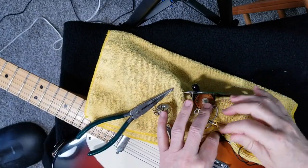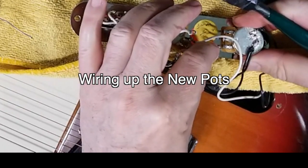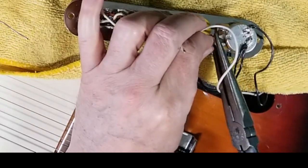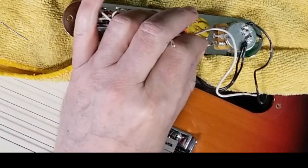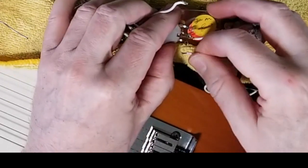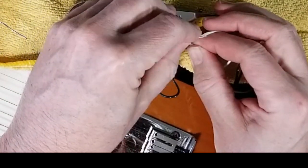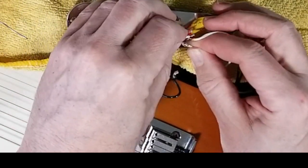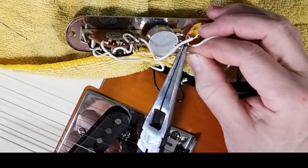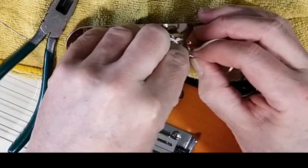All the parts are off. What I like to do is get these in the hole and turn the wire around and kind of press it in together, so that way it feels like it's stuck in there. Even without the solder, I want it to feel steady. Then over on this other hole, I'm going to do the same thing — except that hole is going to receive two wires. I'll thread in the second wire and see if it fits in the same hole.